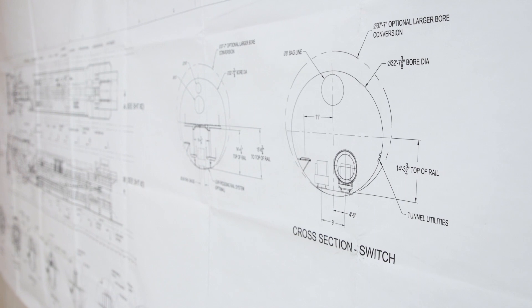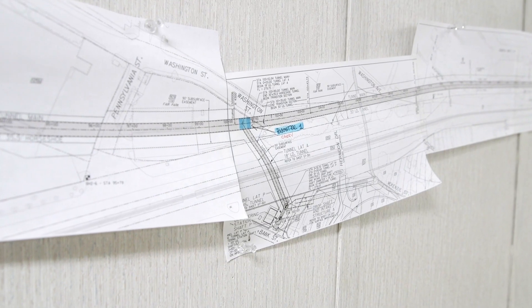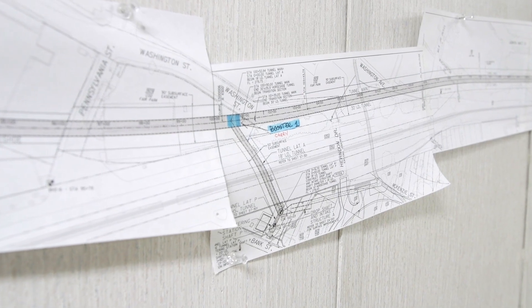This tunnel was designed to have two diameters since it's covering a large area with multiple drop shafts. As you go downstream, the flow requirements increase with each drop shaft, with the final one-third of the tunnel requiring a significantly higher flow rate.